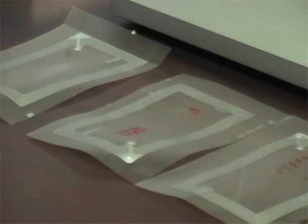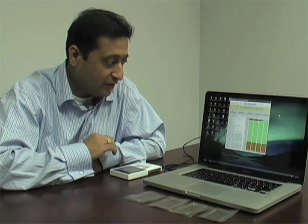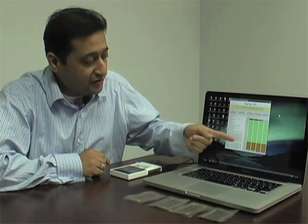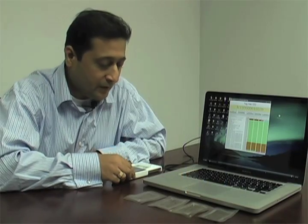Let me show you how our M4H RFID authentication works. First, let me talk about provisioning. When the chip is created — whether it is still in the form of a wafer or it's an RFID tag not yet put on the final product — some parameters are collected from the chip. These parameters are externally encrypted using a key known to the reader, then provisioned back onto the chip's memory. If I place this tag on a reader, what you see in the orange box are those PUF parameters that were extracted, encrypted externally, and provisioned back.